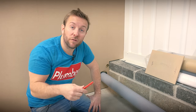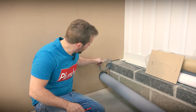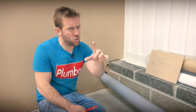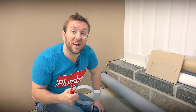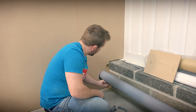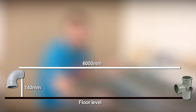How did I know how far to drill the hole? Well, I try and run along the theme that for every three metre length of pipe, you want at least two clips. And that's why our clip depth is gonna hold our pipe out this far off the wall. We just pop our clip on the wall here and that's bang on right for getting that in. A quick tip about clips - a lot of people make this mistake. There are two types of clip: one is for the actual pipe run, but one will take the width of a socket so it's bigger. The pipe's gonna rattle about on that one. You're more likely to want clips that actually fit the pipe itself. So I'm gonna have it up here - the bottom of our pipe is about 14 centimetres off the ground.